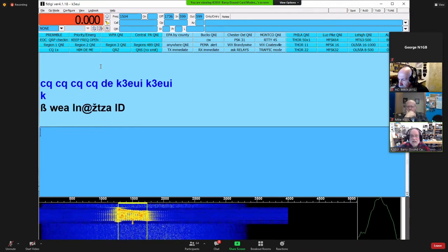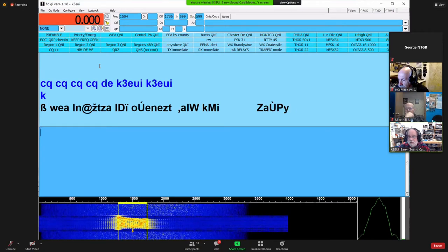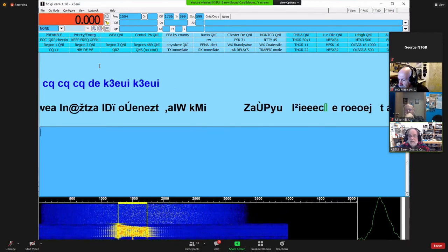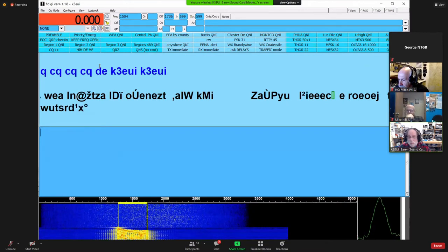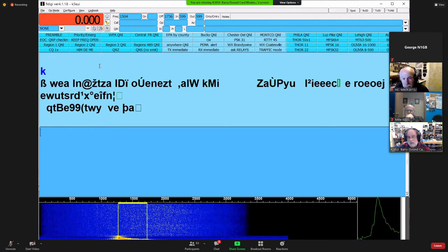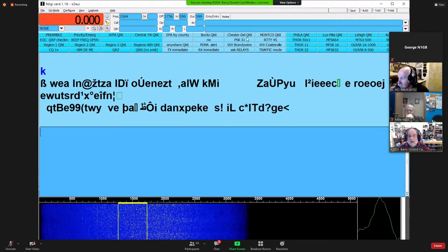So I don't know if you heard that. I'm not sending the TXID signals, and MFSK always starts with the low tone, ba, dee, dee, dee, dee, dee, dee, dee. So if you hear something and you're not sure what it is, but you get the beginning of the transmission, if it starts out, ba, dee, dee, dee, dee, dee, dee, you're pretty sure it's one of the MFSK modes.